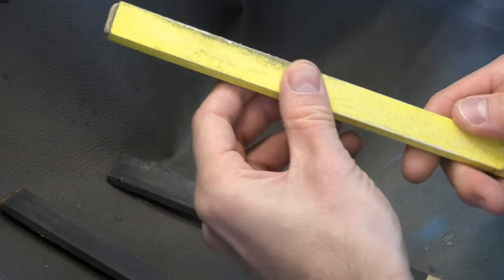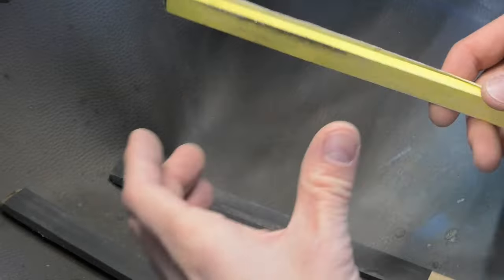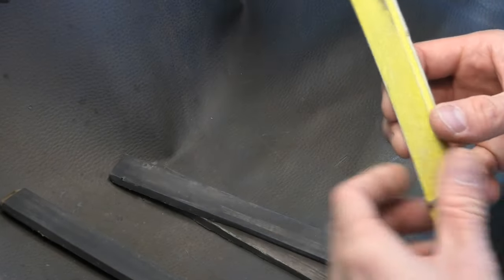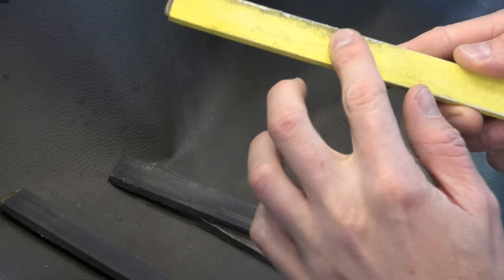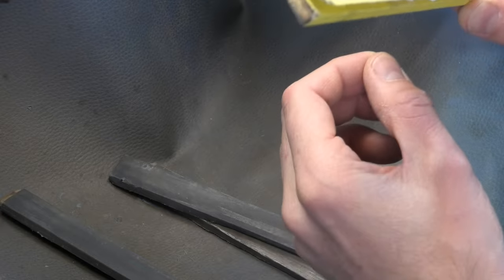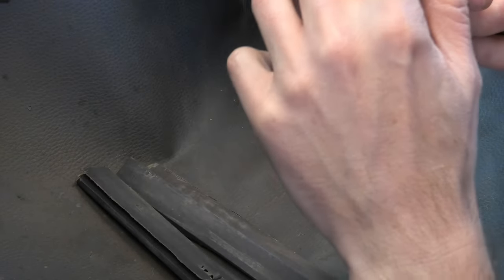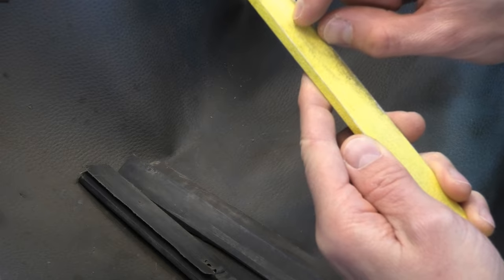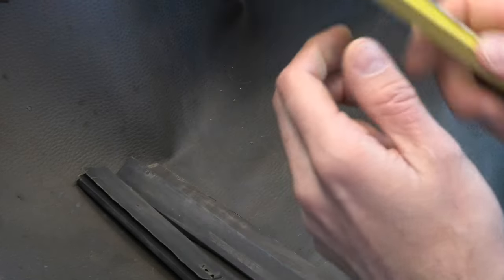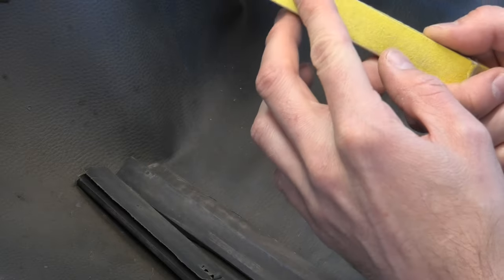This one I don't necessarily recommend for jewellery — it's bright yellow sandpaper from the UK, really meant for woodwork. I actually found a roll of it when I was locking my bicycle up before work; some builders had left it on the pavement, so I made a buff stick out of it. It does come off a bit papery working on metal, but it's useful if you need something coarser. On silver, gold, or platinum I'm a bit nervous — it's very gritty and if just one piece of grit is sticking up higher than the rest, you're scoring lines in your metal. Platinum is so hard-wearing that it's really difficult to get to a bright polish, so you're almost creating more work for yourself by using a rougher buff stick.